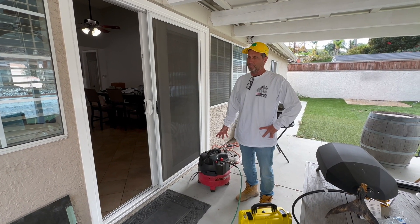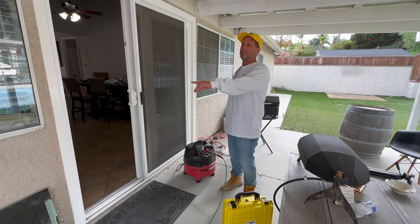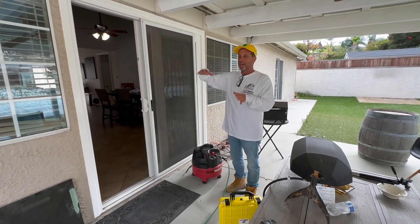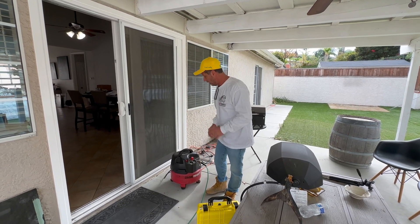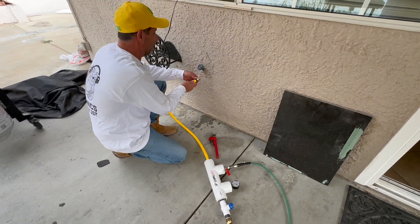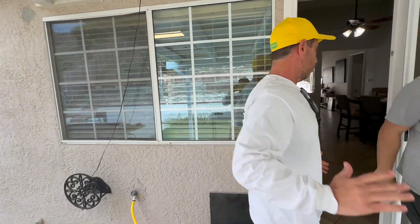We have a cheap six-gallon pancake compressor. We're going to inject air — shut it down at the front of the house, inject air into the cold water side. That air goes down into all the cold water pipes, and wherever there's a leak it lets the air out, which then boils through the saturation of the previous water that was leaking. We hook up our pressure rig to the hose bib on the side of the house, screw right up to it, go back, and shut the house off so no more water is coming in.